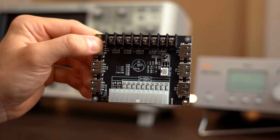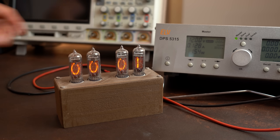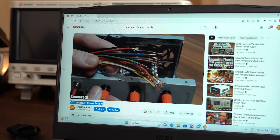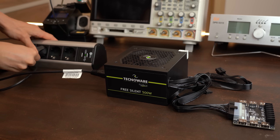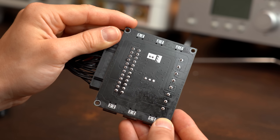Last but not least, this ATX power supply breakout board you can get for around €3. Having 3.3V, 5V, and 12V available is crucial when working with electronics, but even cheap lab bench power supplies cost money — whereas some of you probably have an ATX power supply lying around for free. I previously showed how to convert one into a lab bench supply, but with this breakout board it is far simpler: just plug in the 24-pin connector, hook up the supply to power, push the on button, and you have all the voltage rails you need. The copper traces and terminals are beefy enough to draw quite a bit of current.